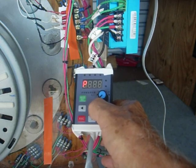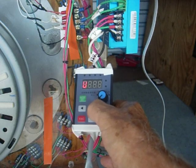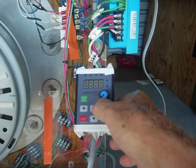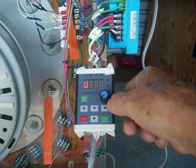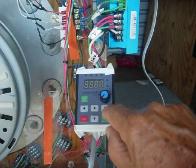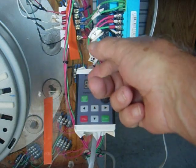P is square wave versus sine wave — I think square wave is on. U is the number of poles, and that's where I select three. To make changes, you select the parameter you want, use this key to increment the number of poles, and these two keys are for off and on. Once you've set what you want, hit enter and move on to the next selection.